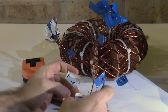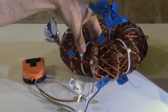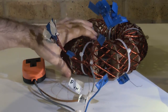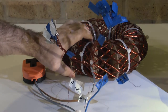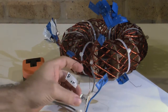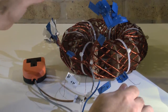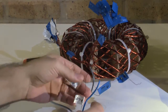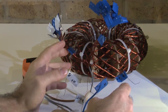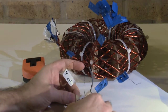The connection is similar to what was used with the ancient Hex coil. The dimension is smaller from a torus point of view, however the ring inside is larger. Not sure it will have an effect here because it's much more compressed. I cannot at the moment compare both of them, so let's just see and explain and measure what we have here. There are two core sides - one side connected to white and the other connected to blue. They're probably counter-running. He wanted to provide me some measurements or layout of the coil, but I haven't seen that yet.